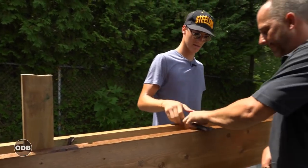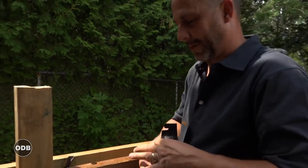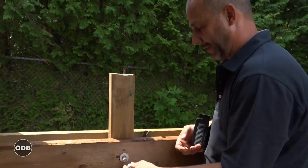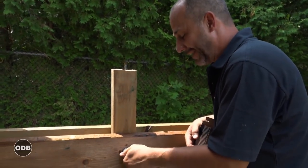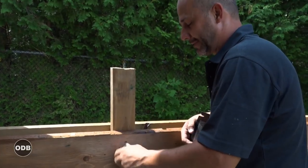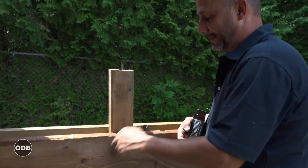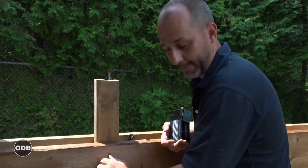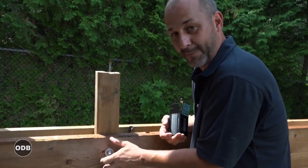Important to note: I've seen a lot of guys mention a lot of different hardware. The reality is that drill bit with this nut and bolt — it is an exact fit. You have to hammer the bolt through the hole. That means it's a direct load transfer, and when we've got these boards leveled off with the screws, they're not going to move around because we've given no extra space for that to happen.